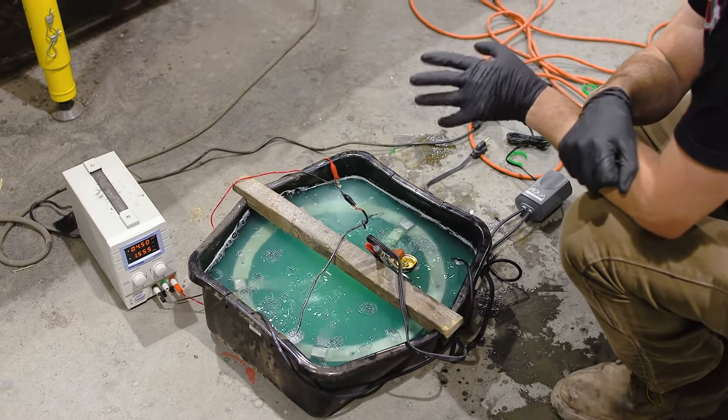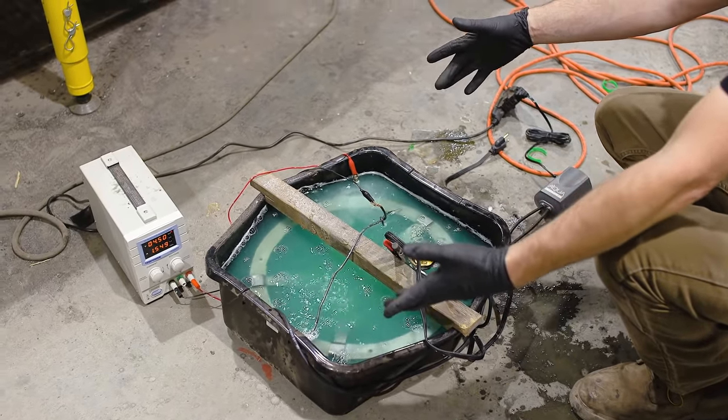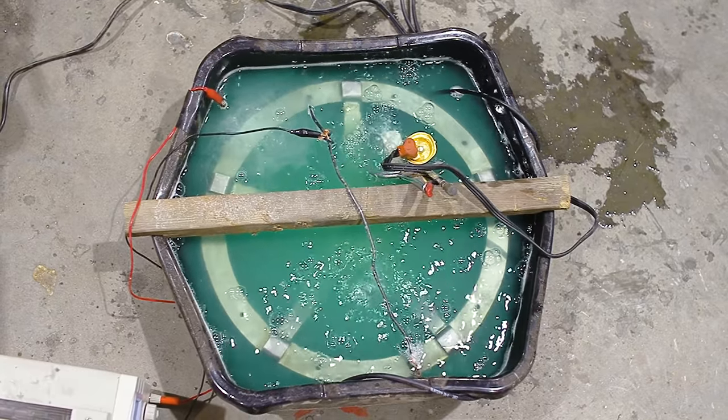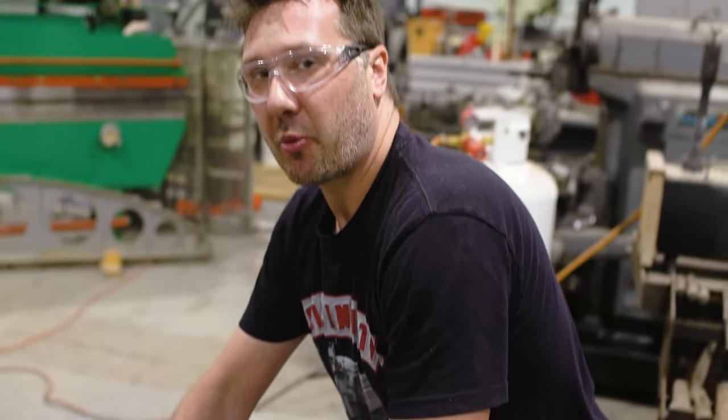And it's gonna be a really thin coating, probably less than 1/1000th of an inch thick, but I think it's gonna add some brightness to the overall part and hopefully maybe even give it some rust protection. So as we're waiting for this nickel plating to do its thing, I say we make a cool handle for the jack.